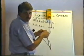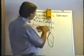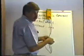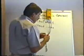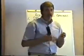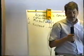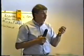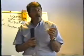You can see it's charging up — the meter's changing, increasing in numbers. Obviously, this capacitor is taking a charge. That's what they say: it's taking a charge, so it's good. Well, in a way they are correct — it is definitely taking a charge. But unless you have another capacitor of the same value and a stopwatch to time how long it takes to charge, you don't know if it's the correct value. A 100 microfarad capacitor will charge up just like a 1,000 microfarad — it just charges faster. You need to know exactly how many microfarads it is.